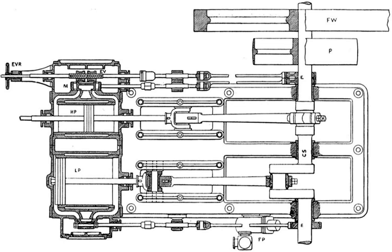When operating, the additional advance moves the gridiron valve to apply cutoff ahead of the main valve. To vary the expansion they provide, the stroke of the eccentric drive can be varied by an adjustable linkage. When this is adjusted to zero throw, the expansion valve remains fully open and the engine works without expansion. Although the use of a secondary gridiron valve was an early technique, it also remained in service with increasingly sophisticated valves and actuation throughout the history of stationary engines.